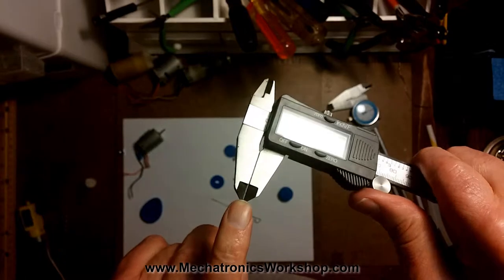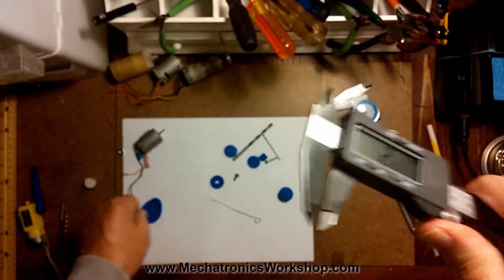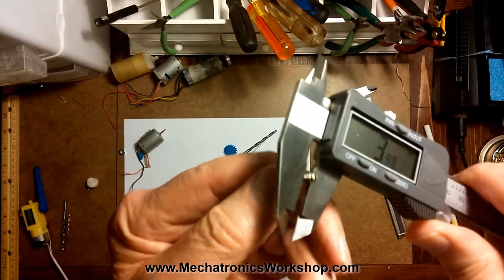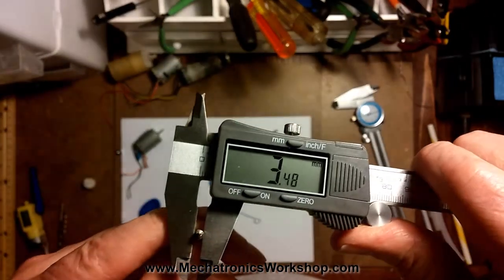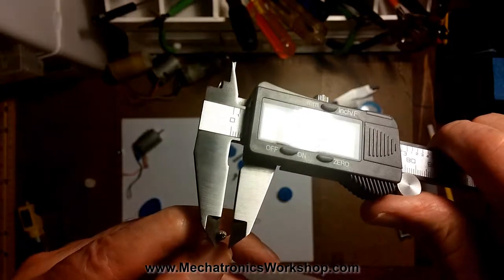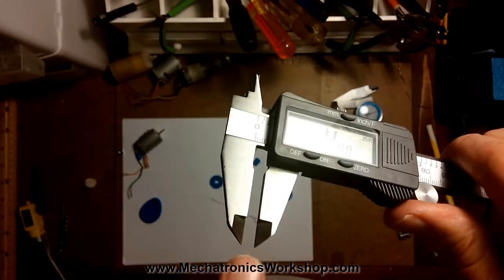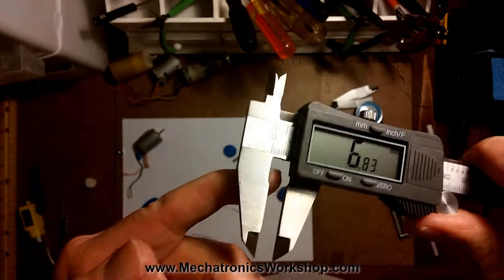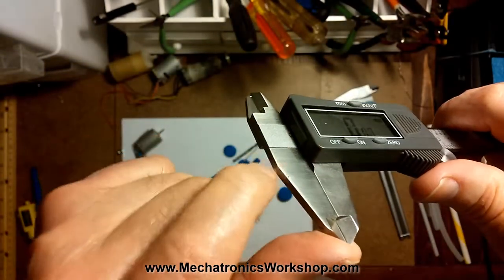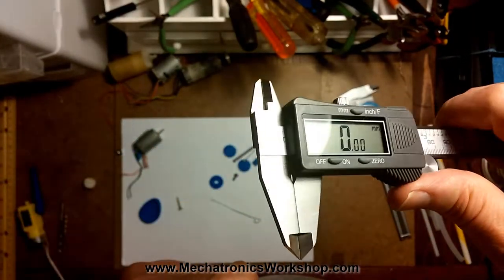I wanted to point out why it's so skinny down here at the tip of these jaws — I didn't know what that was for a long time. That's just to be able to measure really tight spots, like inside the thread of a screw. If I try to measure it with the fat portion of the jaw, I'm getting the threads in addition to the main body of the screw, and I get 3.5 millimeters. But using the skinny edges here I get 2.98 millimeters. So that's what these skinny ends are for: getting into tight places. And the opening in the jaw is for when you've got something with a lip or edge — it can help you close this portion against some material while still getting past some kind of an edge.